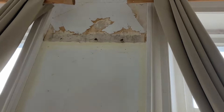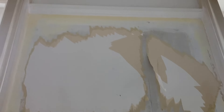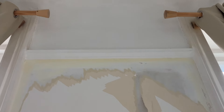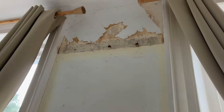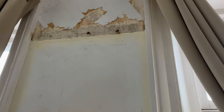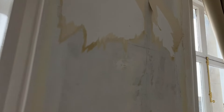The wallpaper's coming off the wall — I've just got the woodchip at the top which is a bit more stubborn. Once you wet it up it comes off quite easily, which is great — just get the scraper behind it. I'm going to score at the top and do the same. What I do with the scoring is crisscross it, and when I spray it with water the water soaks through the paper and stops the glue from working, so that makes it a lot easier to get off.